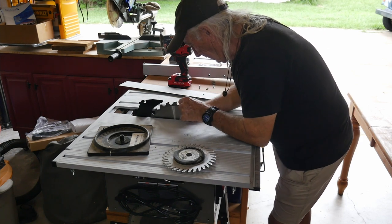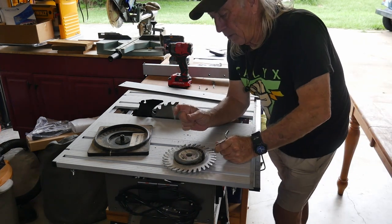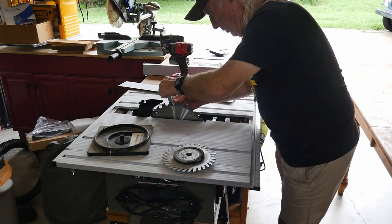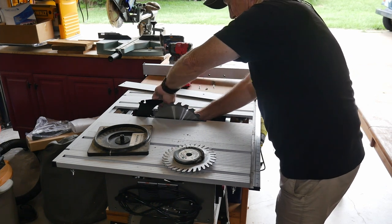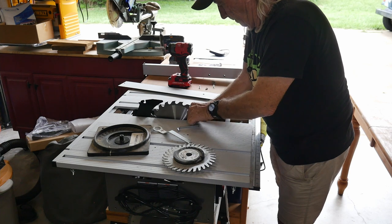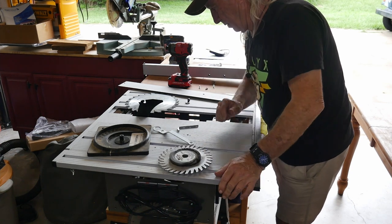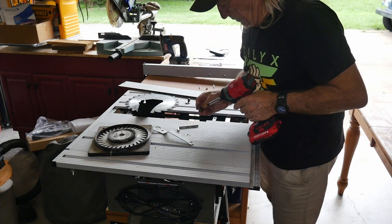It's really thick, so the first thing I wanted to find out was whether this is adaptable to that saw. Just looking at it right now, I think the answer is already no — you need a fairly long arbor shaft to mount the blades because you're going to be taking up quite a bit of space with the blades. This is not plugged in, by the way — she's not plugged in. Yeah, there's not enough shaft for that dado kit. That's a shame because I've used that kit before and I really like it.